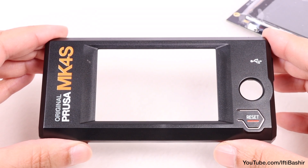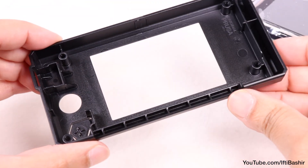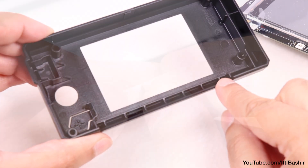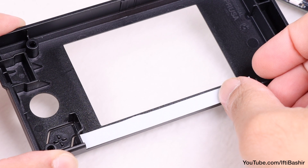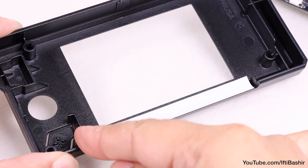With all that to hand, we're going to start with the new injection moulded LCD cover itself. Looking on the inner side, note the recessed channel across the inside bottom edge, specifically in place for an adhesive reflector. Go ahead and carefully peel back the adhesive sticker, before positioning the reflector strip over the recess.